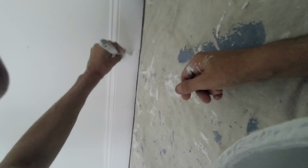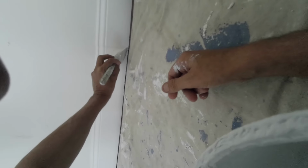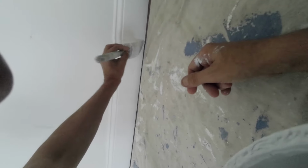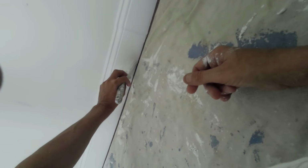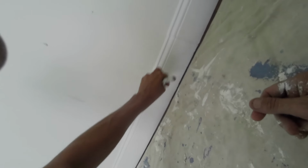See that? Jiggle your brush in there a little bit. These are two conjoined pieces of wood. Be careful because it'll drip in that area. So I usually go like this and then draw up. Okay. Crevice there. Fill that up with some paint. Continue down. Do not touch the floor. There you go. Now we're going to blend over our work, not to strike this piece because it'll drip. So we're going to come back over it this way. All right. You guys and girls are getting good at this for sure.